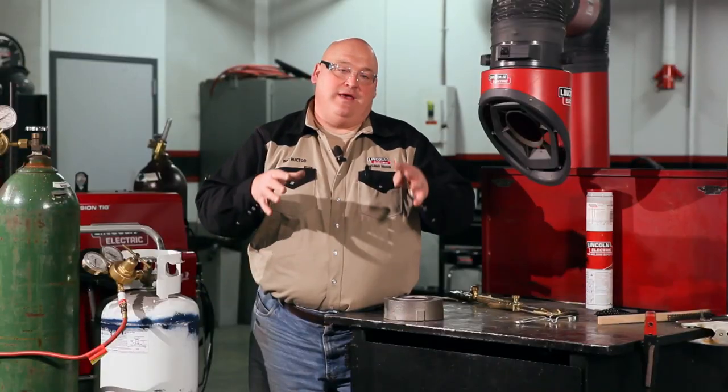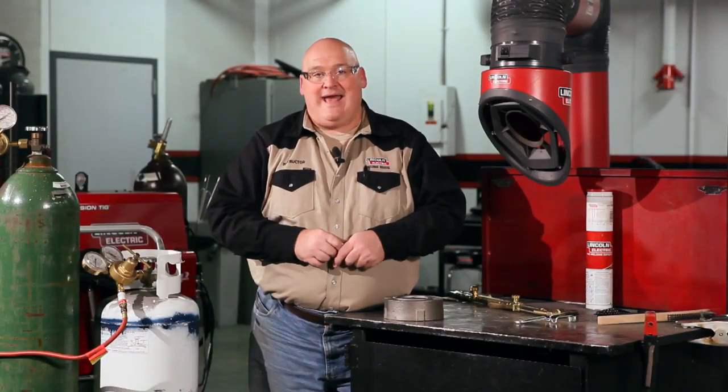Generally, that'll allow the casting to stress relieve itself. However, we don't have all the options of doing that at home. So the best thing is you can bury it in sand if you have to. All we need to do is control the slow cooling of the casting.